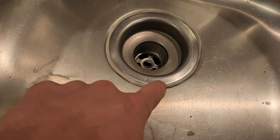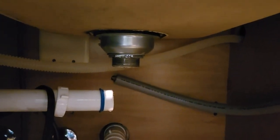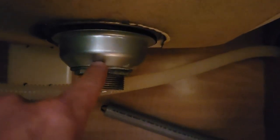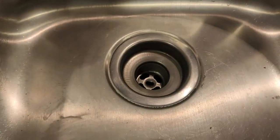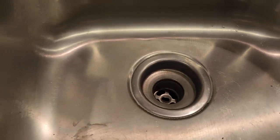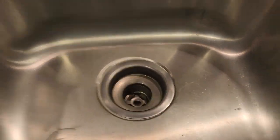I pressed the drain back in. I think I used a lot of plumber's putty but I can wipe off the excess when I'm done. I'm going to go back under — I've got the other gaskets underneath — slip the gaskets in and put the pan back on. You can see the putty is sort of filling the hole down there. I'll button everything back up and reconnect it. I put the drain back on and tightened the nut back. We've put the drain back in and we're going to give it a shot for the final time.